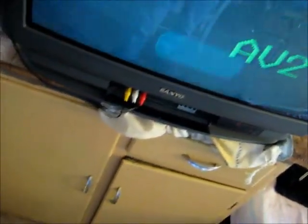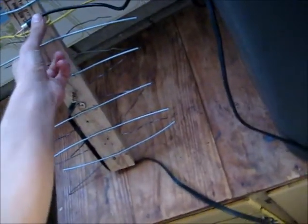Let's just try HD VHF and see if I get this right — it should work in theory. That's how you do your VHF antennas: you have a little loop in the middle and these things act as a reflector. That middle bit just connects under here and that just flips around. It doesn't connect back up because it shorts — that's how it's supposed to look. It's supposed to be a reflector; it captures what these catch. But it's not working.